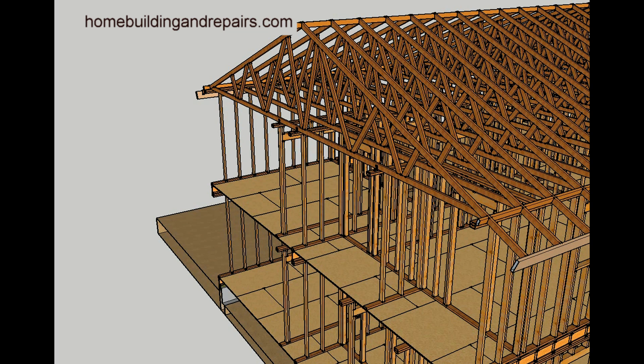This is also going to be a problem if you store things in an attic — a truss ceiling with an attic can have this problem as well. Any additional weight could create a problem. This could also be a room addition where someone builds over an existing truss system that was not designed for that additional weight.